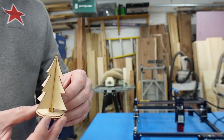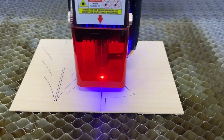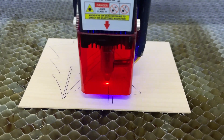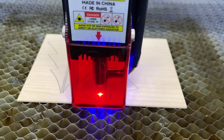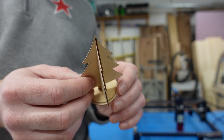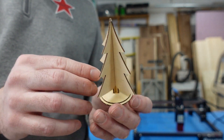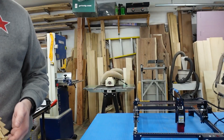To show the detail of cutting ability, we cut a simple stand-up pine tree from 1/16th inch plywood — about 1.5mm — with a slot that fits together into a base. This was done at 250mm/min, two passes at 90% power. So again, this laser is not just for engraving at 5 watts — you can definitely do some cutting as well.